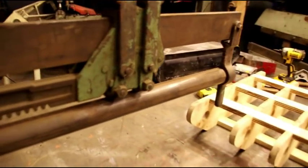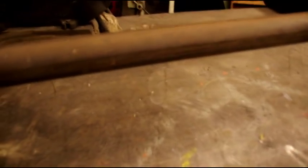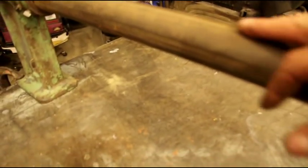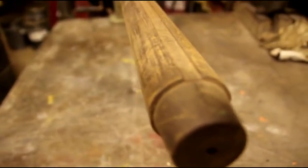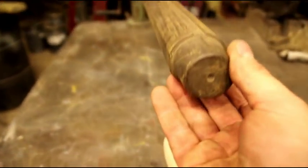There's the old tank for reference. I've got the grooving machine out here — this is just a hand-operated Pexto machine. This basically has one job and that's to finish off the seam. This bottom part here is solid bar. That side has a groove in it so we can set the seam to the inside of the tank, and that rotates. There's a flat side if you just want to smash it down, another smaller groove on the other side, and an even smaller one on the bottom.